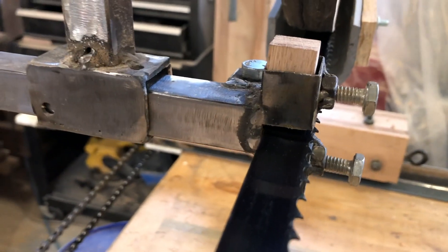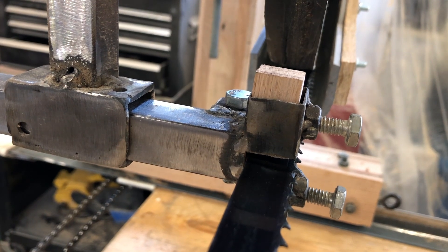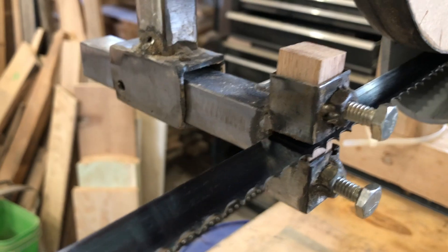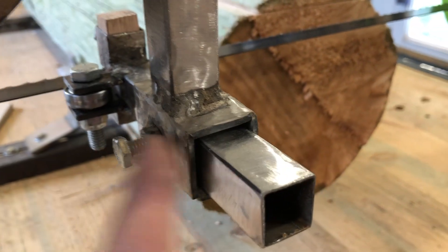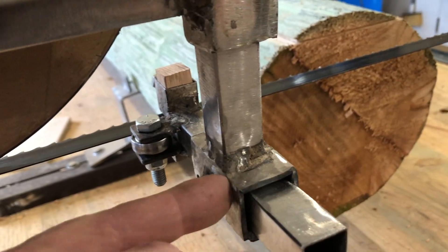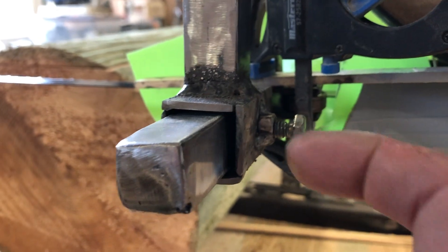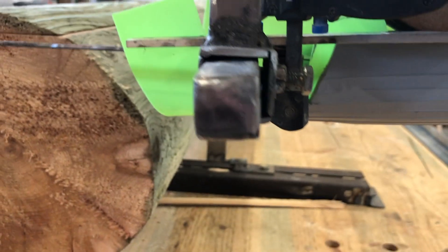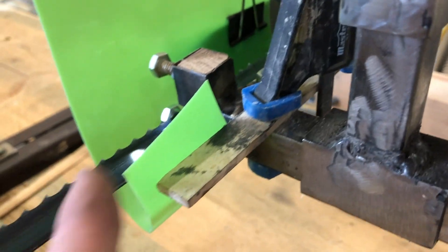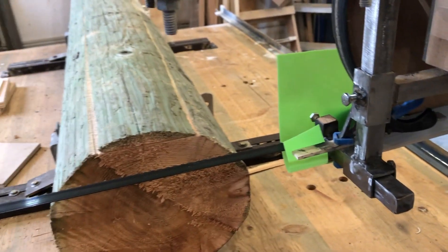All right, we're back in business. I've got the saw blade now sitting well into the blade guides, so that should really help with the stability of the blade. I did make sure that the bearing is on the far side of the guide. And while I was in here mucking about and welding, I did make one other minor change — this bolt here holding in this piece. On one side I had the bolt coming in here; on the other side the bolt was coming in from the bottom, which didn't provide much clearance. So I fixed that and put the bolt going in the side now, giving me a little more clearance on the bottom of the sawmill for smaller cuts. I'm also doing a little experiment with dust collection, just trying to catch some extra dust.